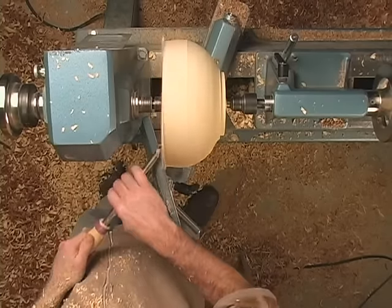I normally advocate a little sharper bevel than that, but for getting started, 45 is going to be just fine. I want my sweep or my cutting edge to be straight and my bevel here to be concave. That'll naturally happen because that's the arc of the grinding wheel that causes that concave surface. This whole surface here will be concaved. Let's go ahead and grind one.